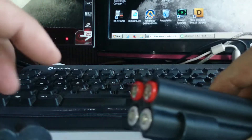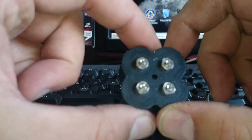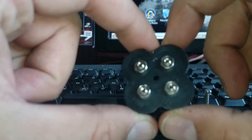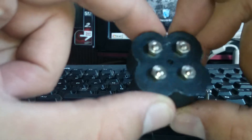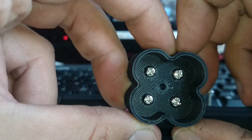I've designed this so you can use paper clips, twisted wire, crimp terminals, or a number of different things for the connections. Personally, I prefer to solder — it's a much more reliable option. I also use stainless steel screws, which are better for corrosion resistance when batteries leak, and it means the cells are very easily replaceable, especially in the field.